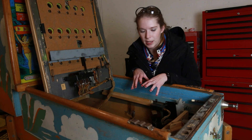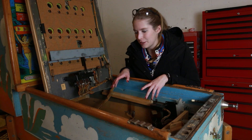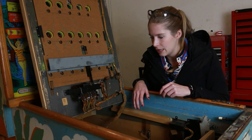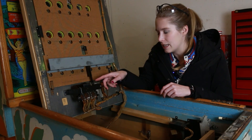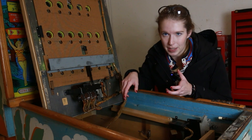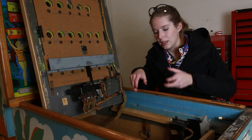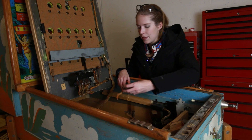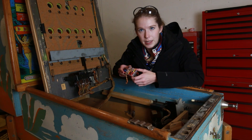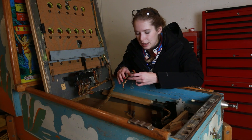A few things come to mind when I think of how we can update Miss Creaky. The first thing is motors. The motors in Miss Creaky are old. It's apparently called a squirrel cage motor — I'd never heard of that before. What I do know is that this motor uses the ridges and valleys on the different cams to open and close switches and tell the rest of Miss Creaky what position the motor's at. So if you need a motor that has some awareness of its own positioning, a good thing to use would be a stepper motor. But in order to run a stepper motor, you need some sort of driver. I really like this board, which can control up to three steppers at a time — it's usually used as a CNC shield. For this lower cabinet where we have two motors to control, this could be a good option. In order to read out where those motors are, and if signals are reading high or low, we need something like an Arduino.